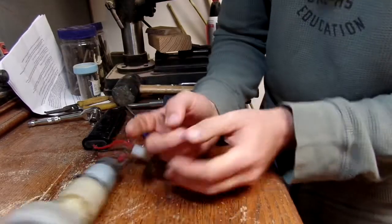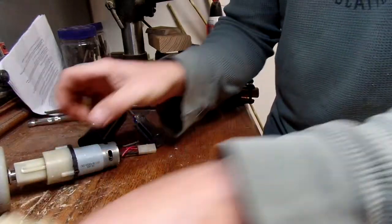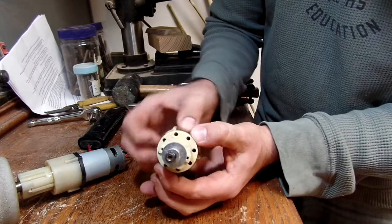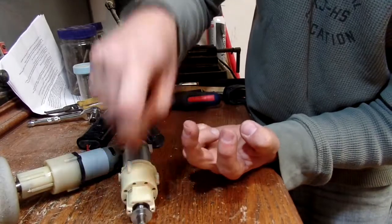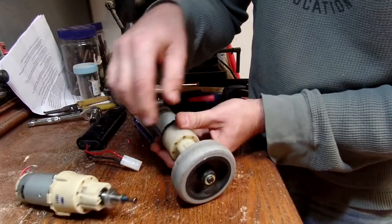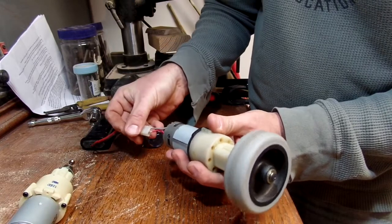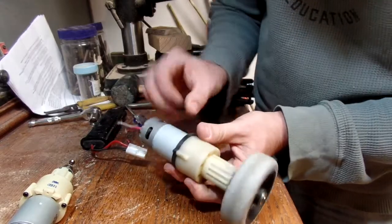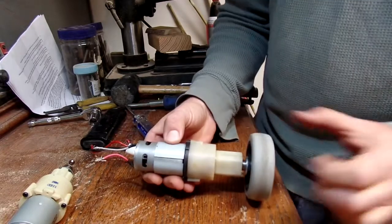You have to block those. They're like little teeth — there's a valley, and then there's teeth in between these little holes. Between the holes there's a valley, and that whole setup spins in there. What you've got to do is drive a screw down into these little holes so that it catches, and then you're going to get the torque you need so that it doesn't stop when it's got any weight on it. You sure don't want that with a combat robot. The first time it runs into something or has a little weight on it, you don't want it to stop.